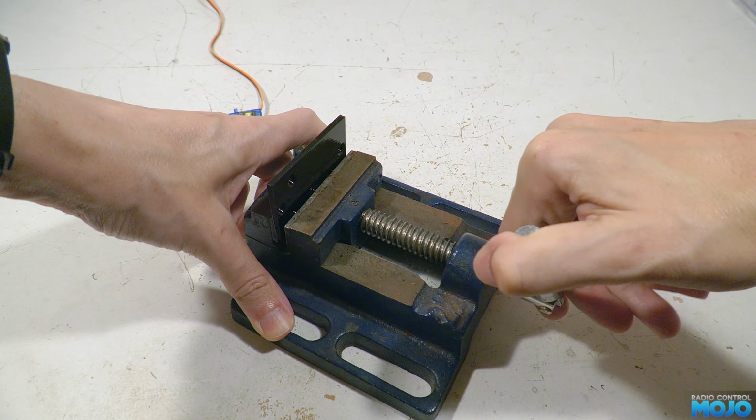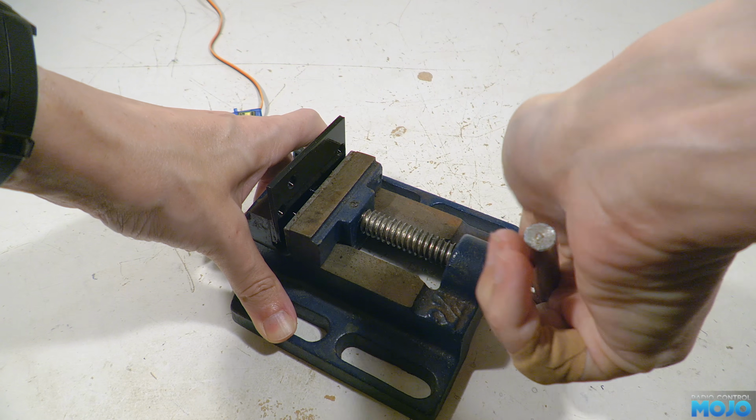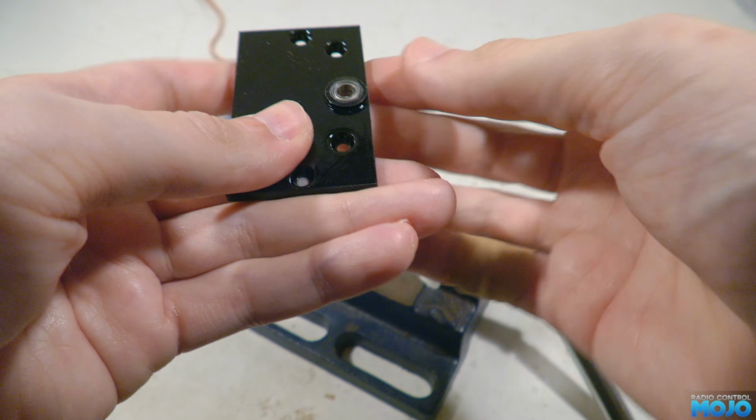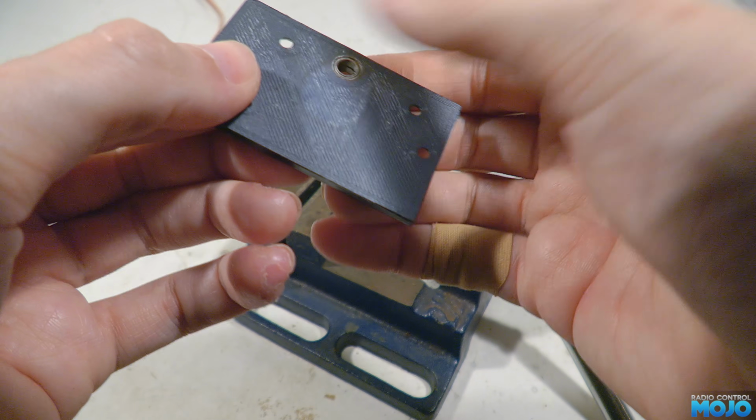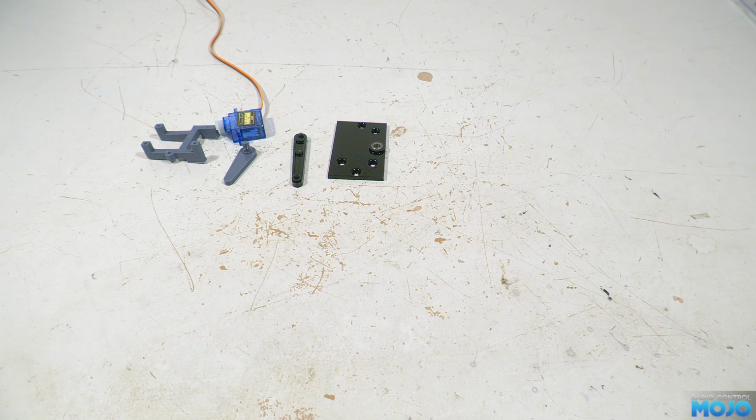When done, the bearings should be flush top and bottom, and the swarf from pushing the bearings through should work its way out of the bottom. Clean it up if there's any still attached, and that's all the bits ready to put together. If all the preparations have gone well, this is the easy bit. Right, step 1, the follower.